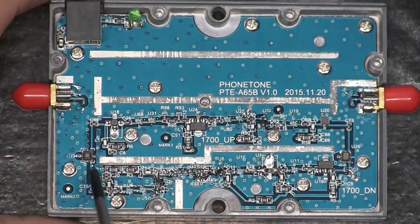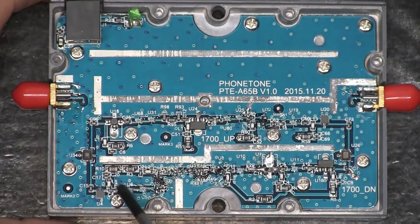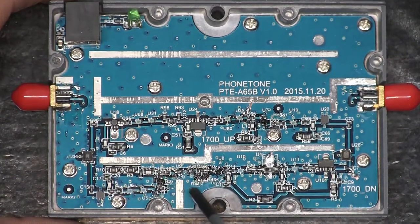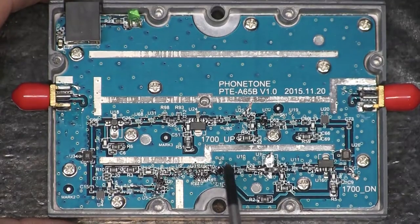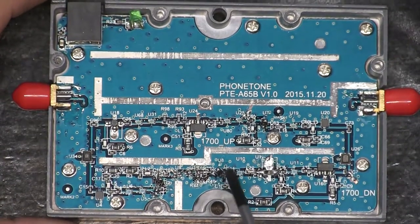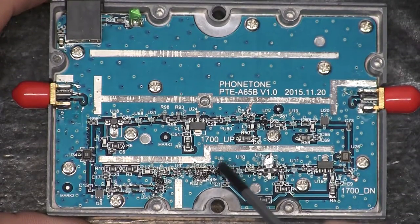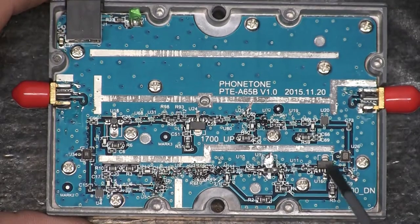On the downlink side, what I've got here looks to be another band-pass filter. Interestingly, the path goes through two different routes — there's one strip line here and one strip line there. I'm not quite sure why, but the signal is coming in this direction. It hits this little intermediate transistor. Some of these components are mounted at angles because of the way manufacturers recommend routing the microstrip line in certain directions for best impedance. So we've got two different paths here that seem to split, recombine, split back up again, and then recombine at the output stage.